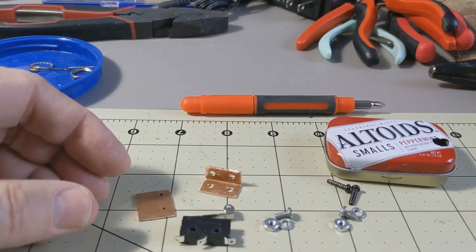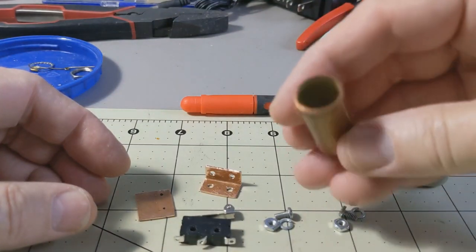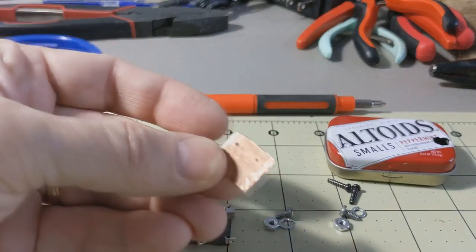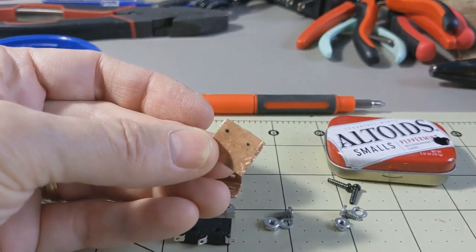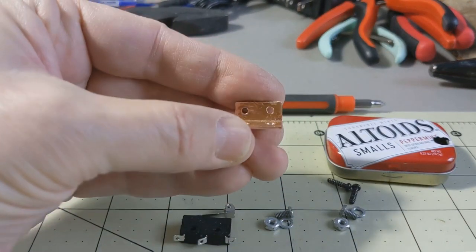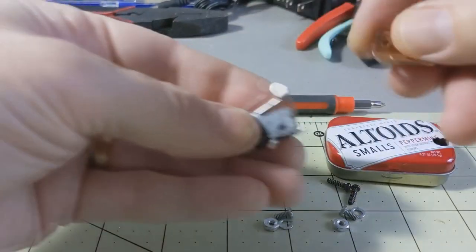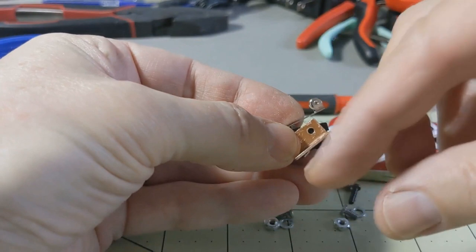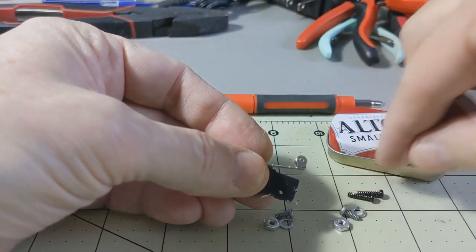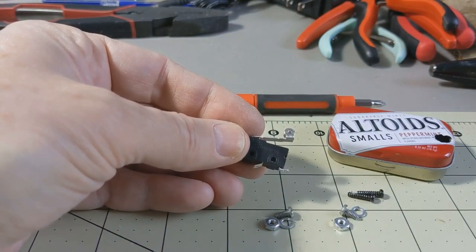In order to do that, I had to make a little bracket. I used a piece of copper tubing — copper pipe — just smashed it flat, cut it to size, marked it, drilled holes in it, and bent it so that I made a little L-bracket. I have a couple of small screws that I pulled out of my junk box, probably from tearing apart another piece of equipment or a computer.